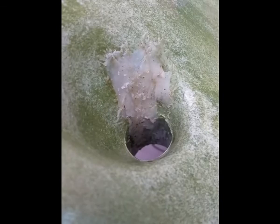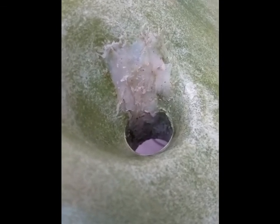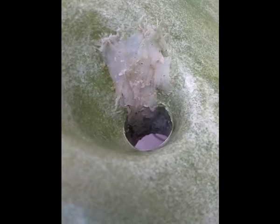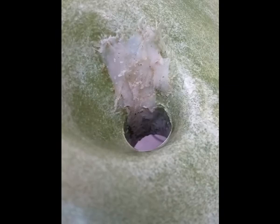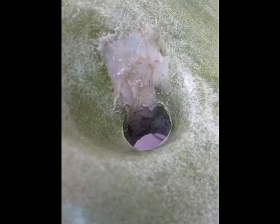Okay, so there's our completed weld. We have several layers merged in together there. And for our next step, we're going to water test it and see how successful we were. We're going to do that simply initially by just filling the scupper hole as far as we can with water. And then obviously we'll have to put it out in the river and give it a genuine test.